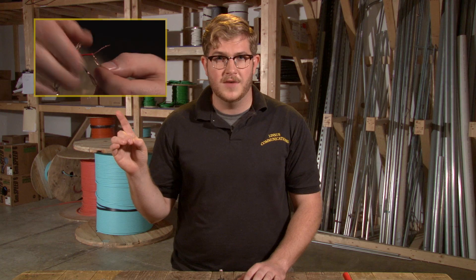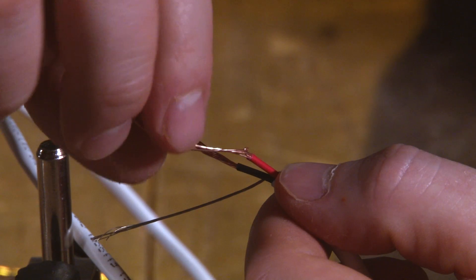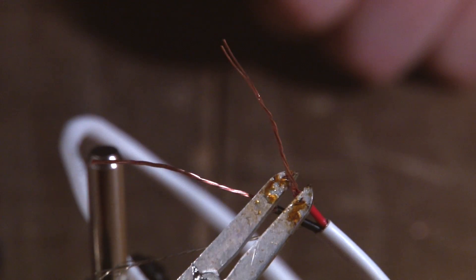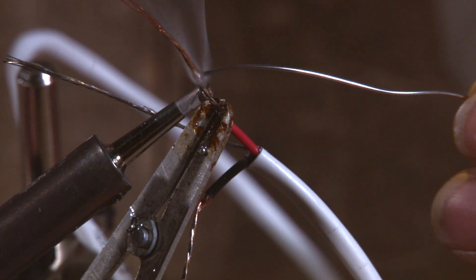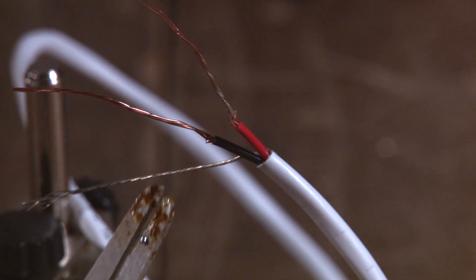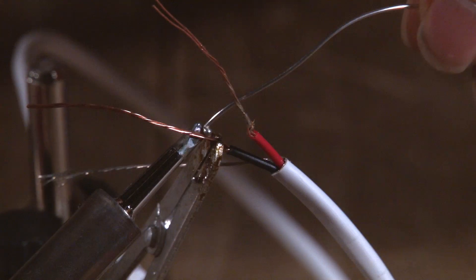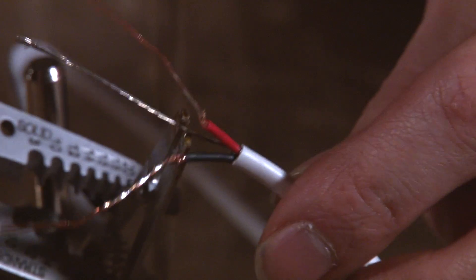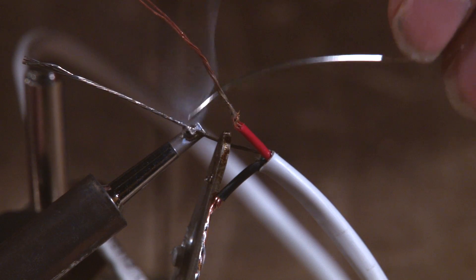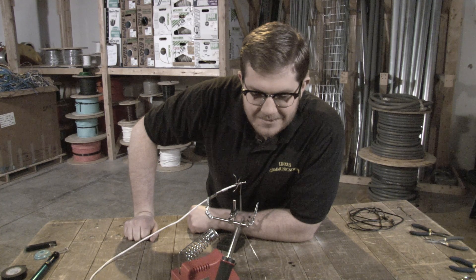If your cable gauge is larger than your connector hole, visit this link. If your cable gauge is smaller than your connector hole, visit this link. Be sure to twist any stranded cables. Place the clip or heat sink on the wire close to the plastic sheath and tin the ends. Tinning is when you heat the wire and allow the solder to soak into the tip. Done correctly, the wire should actually soak up the solder. You shouldn't have to touch the iron directly to the solder. Some solder is toxic, so try not to inhale the fumes.